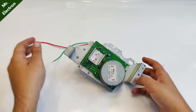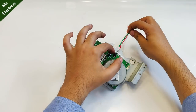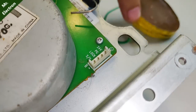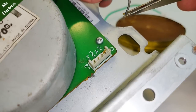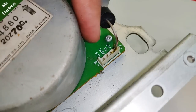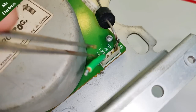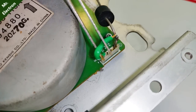Now let's connect the wires. I'm taking out the red terminal from this slot and the green also from this slot — green is going to be your negative. For the positive I will connect it to the 24 volts pin. Let's first place some flux on the 24 volts pin — done — and on the diode terminal also done. Now the positive has been connected, but there is still the S/S terminal. Take another wire and connect it to the S/S terminal.